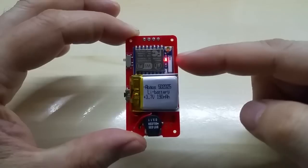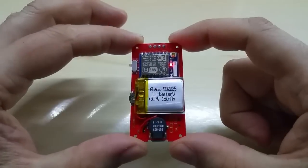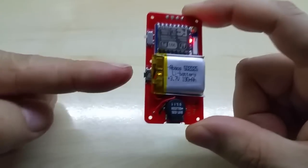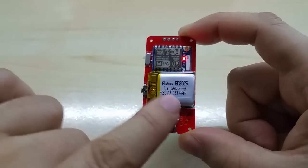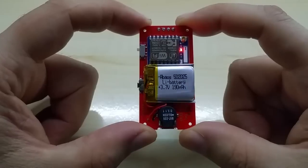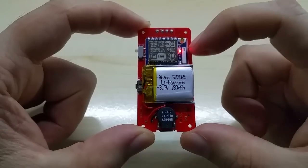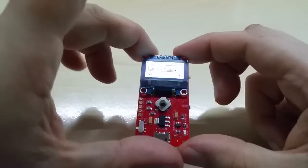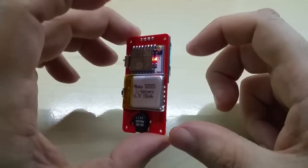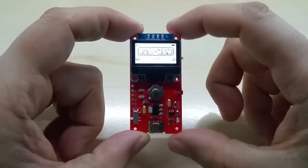It works with the ESP-12 but the ESP-7 is enough. I might disable the LED to save a few more milliamps. This is the speaker, this is the reset button, and this is the on/off switch. It has a 190mAh battery. I've disabled the Wi-Fi on this chip, so it takes about 25 milliamps while running — normally it would take 80 to 90 milliamps with Wi-Fi on.